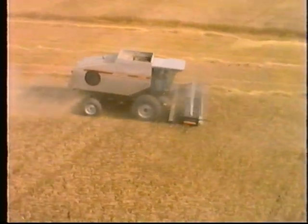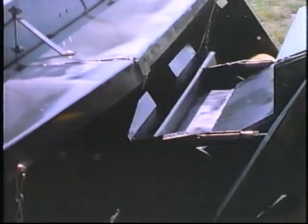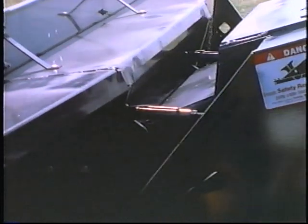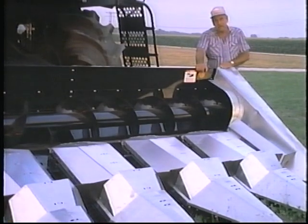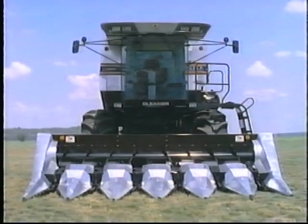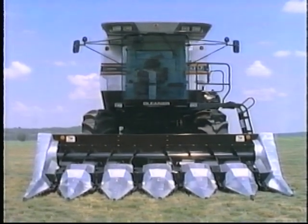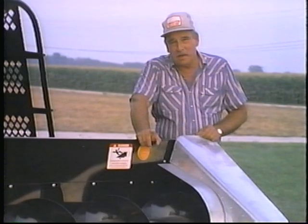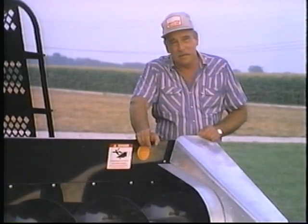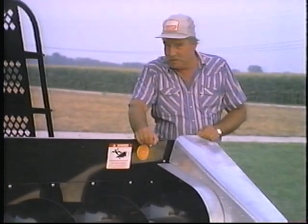What you'll probably like most is how easy it is to change headers when you move from one crop to another. It's easy to line up the combine with the back of the header because of the improved cab visibility and longer feeder house. Then you just raise the header, hook everything up, make a simple adjustment of the concave, and you're ready to go. Our hugger corn heads have features that help you put more corn in the bin. They hug the ground closer than any other on the market, so not only do you get the tall standing corn, you'll get down corn just as easily. And this 14-inch adjustable auger gives more even crop feeding. Overall, it has fewer chains, so it runs more quietly with lower maintenance. And all our headers will fit any Gleaner Series 2 model.